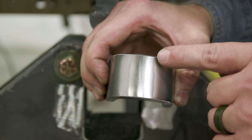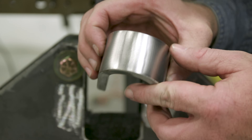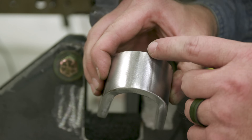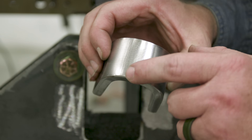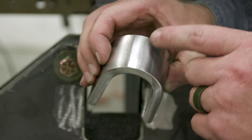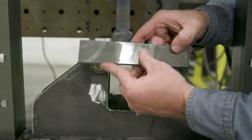On the face bend, you can actually see where everything tied in - you can see the dissimilarities in color right in here - but we got a nice smooth bend on the face. No corner cracking, no slag inclusions, no lack of fusion or impurities. That's what you're looking for. Now if you do have discontinuities, the inspector will measure each one - there are certain parameters it has to fall within. For instance, a little bit of porosity or some undercut is acceptable as long as it doesn't exceed an eighth inch, or the combined total doesn't exceed three-eighths when you add them all together.